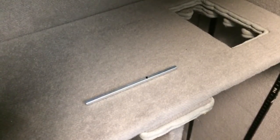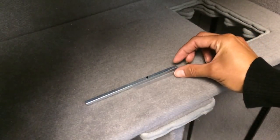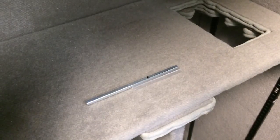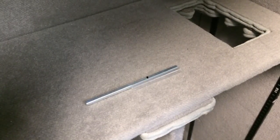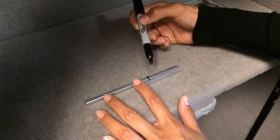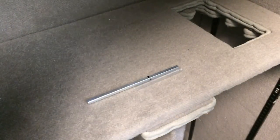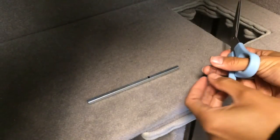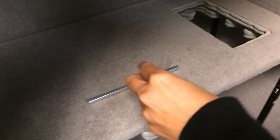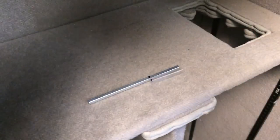It's now time to cut the clear plastic tube that came with your accessory pack. The clear plastic tube is designed to isolate the movement of the spindle as the mechanical lock opens and protect the lock cable on the electronic side. We need to measure it for the door thickness using the spindle marking we had previously, mark the tube, and cut it with scissors to that length. That will be the correct length to protect the lock cable while the spindle is being turned using the mechanical code.